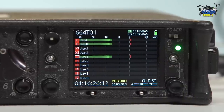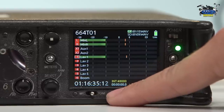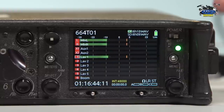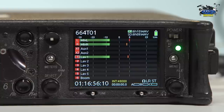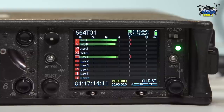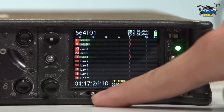Just underneath on the bottom, you'll see the toggle switch for mic and the toggle switch for tone. Because this is going to the camera, I'm not going to turn it on and send tone, but you would flip it over and see your tone go at zero, which is the standard for setting up communication between the mixer and the camera. If you push this over to mic, this is what's called an auditory slate. So if something was recording and the AC couldn't run over with the slate on time but you knew what the scene was — say scene A, take two — you could push this over and there's a little mic inside here that can hear you. You put your face close to it, push that over, and it would record what you were saying into your mixer so that the editor in post can look at it and say, we don't see a slate, but thank you, the audio guy knew what we were doing. So that's for adding an auditory slate to your track.